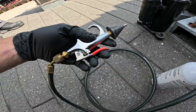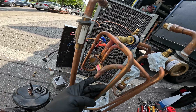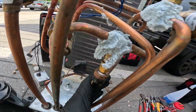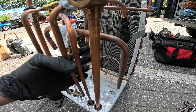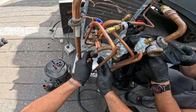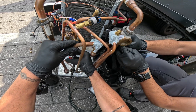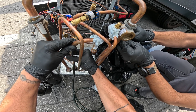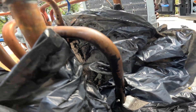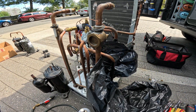On the other side I have this valve handle. We're going to push through one side and it should come out the other. We'll put a garbage bag underneath to catch the solution. We're going to flush this out 20 to 30 seconds on each end. Look at the copper pipe change color — look how much black stuff came out of here. This is bad. Definitely got to flush out this system, and this is why you do that.